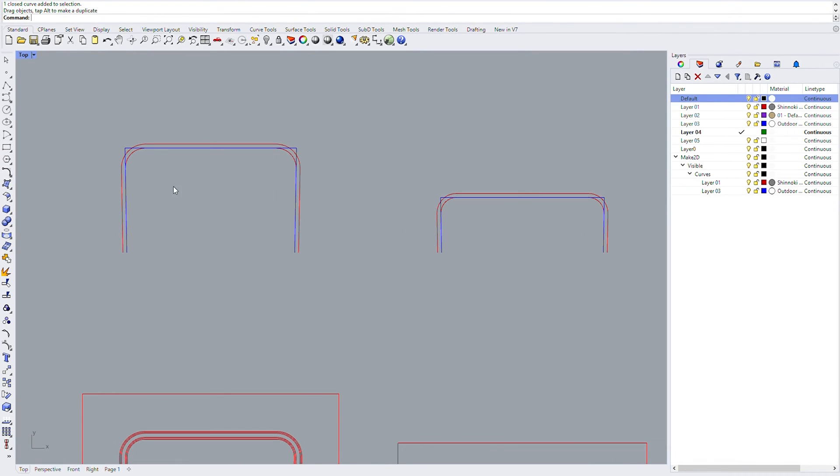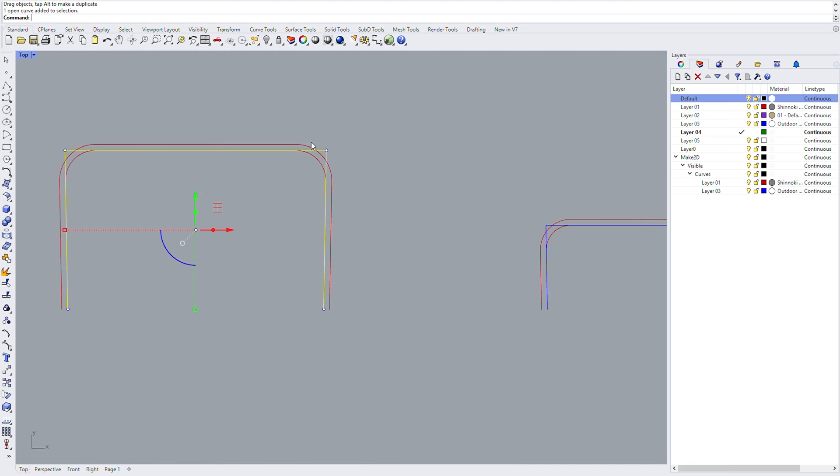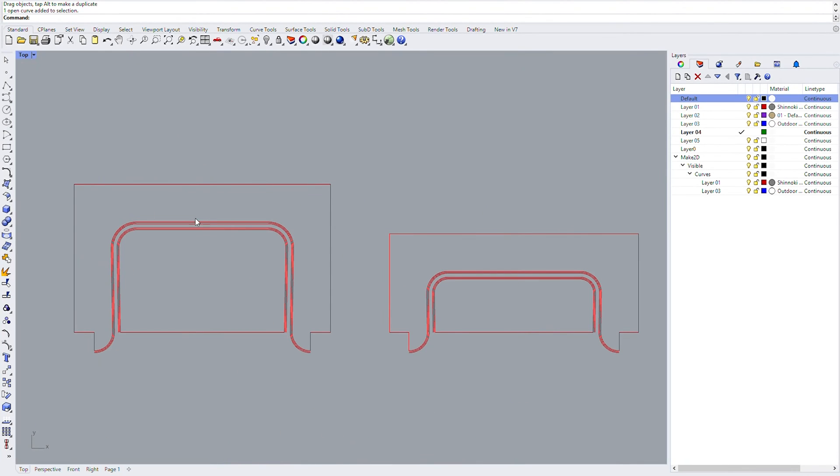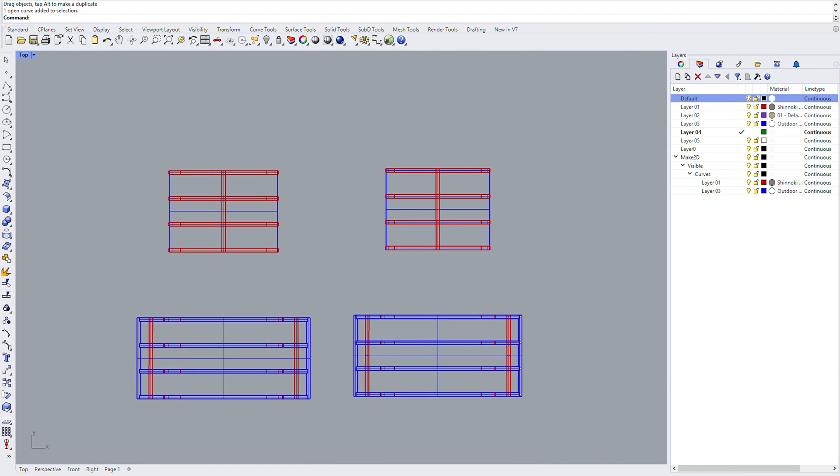From my experience with bent lamination, I've noticed that sometimes when you take an object out of the mold it tends to spring back a little bit. So what I'm going to do for these molds is angle it slightly more than 90 degrees — I've angled it in one more degree — with the hope that when I take it out of the mold it should pop back to a perfect 90 degree shape.